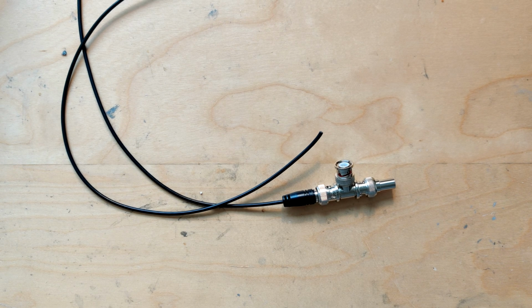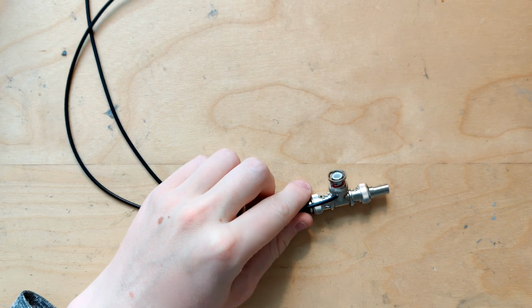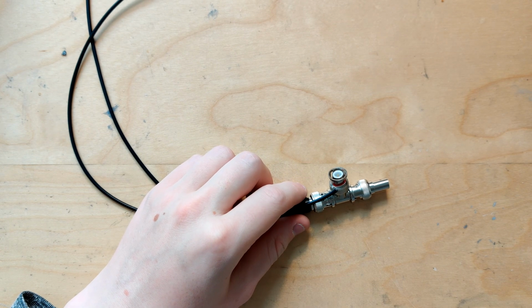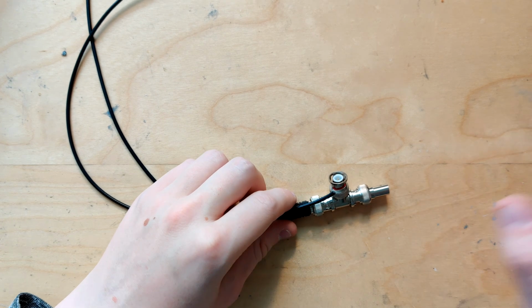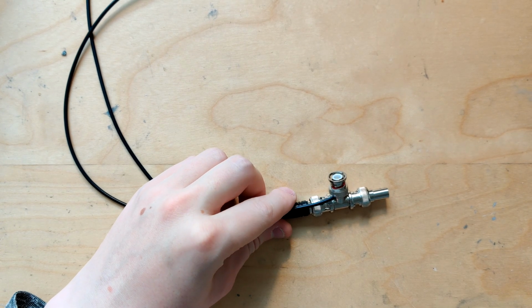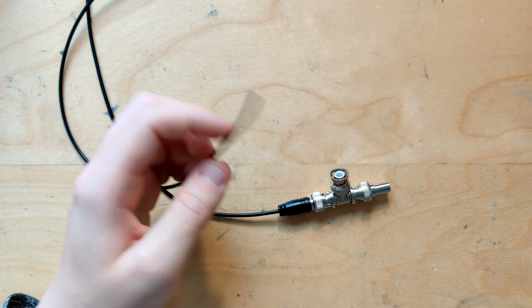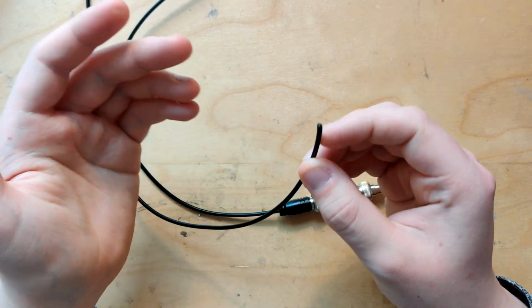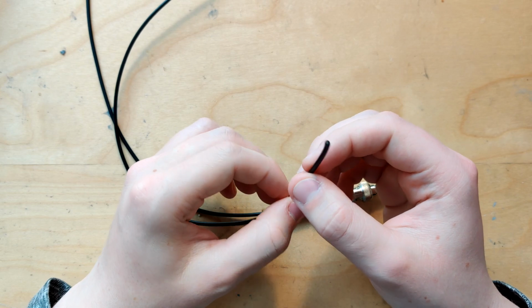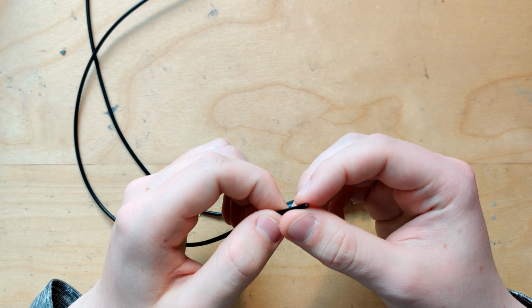And this was a pretty consistent thing across cards until I used the other probe that I had already made of this style, which now reads pretty much exactly the same voltage level that the multimeter does. Part of that was probably also the hookup method, but the probe being more accurate is of course also a factor. But yeah, we are gonna build our little 1x probe right here, which is really good value.